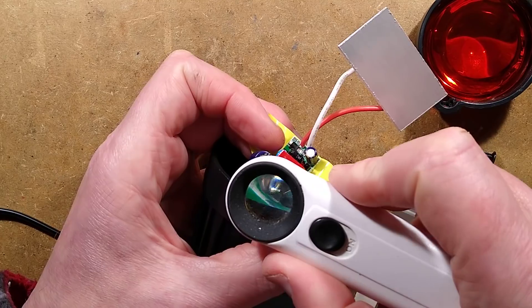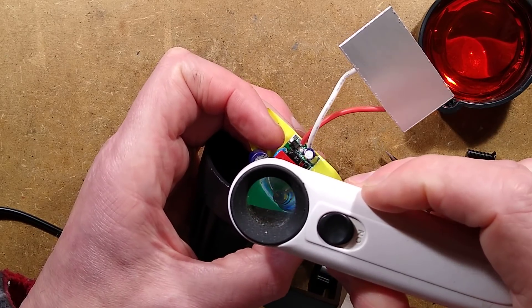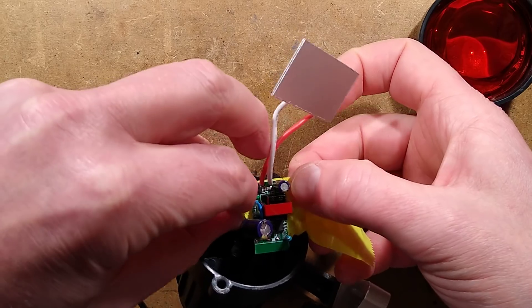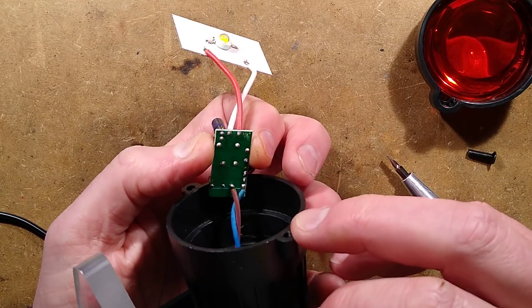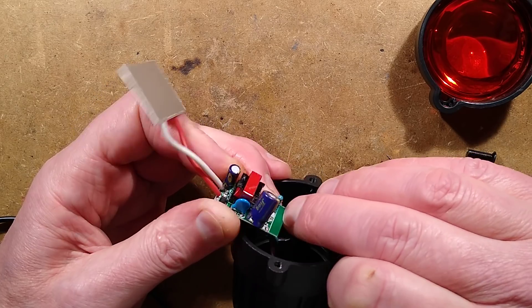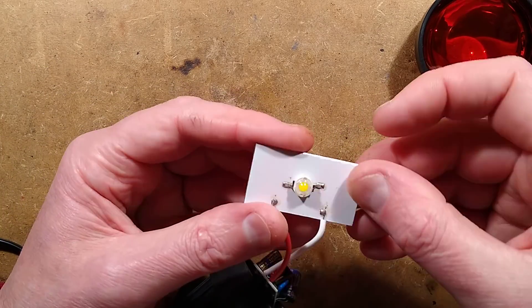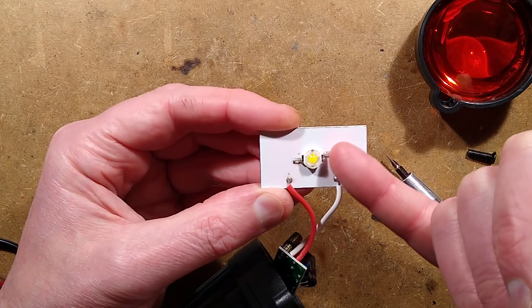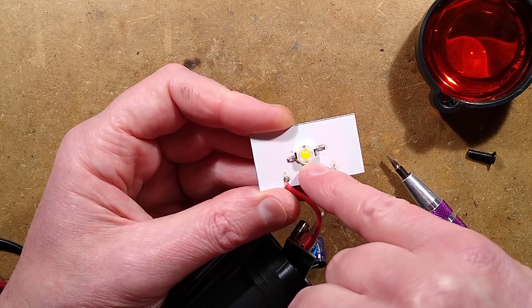I'll use a smaller lens to try to read it, but it's really tiny text — far too many letters crammed on there. I'll make a note of it in the description. The back of it is not an awful lot — just a generic power supply. If anything, it's kind of big because they've left a little groove they'd normally cut off. It's a typical 3-watt power supply like you'd find in a downlight. Oddly, it's on an aluminium substrate, and the only copper pads appear to be the two big ones at the side that it's soldered onto — so they may be relying on those to take heat away. But it's a standard LED.